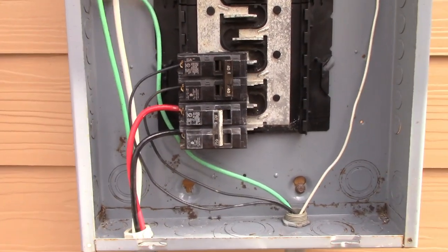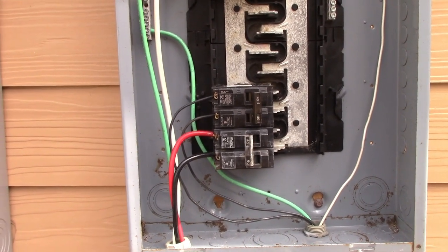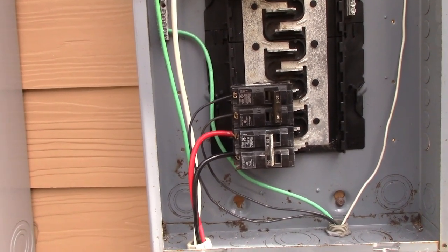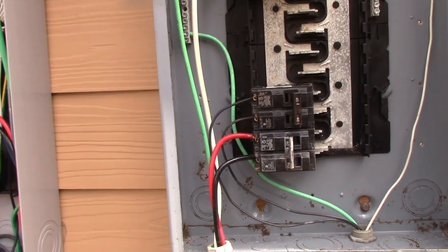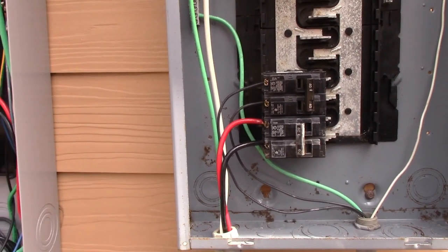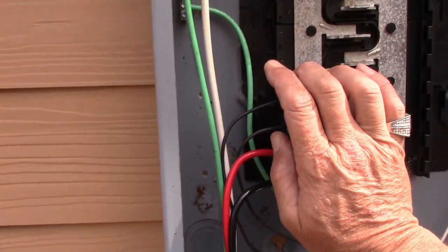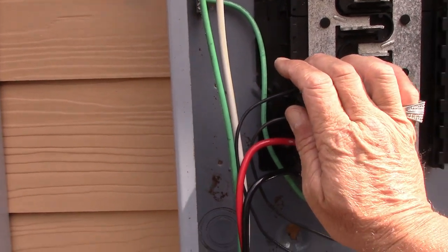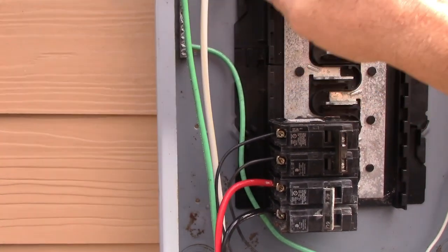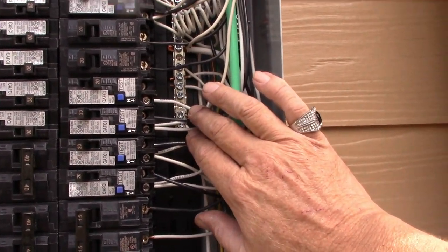First step is to make sure you can get an interlock for the panel you're putting in. If you're building your own transfer panel, you're buying a panel from the start. When you call an electrician, it's good to go out and buy your own materials to save money. Buy the panel, ask whether you can get an interlock for two branch breakers. Make sure the interlock kit is branch-to-branch, not just a main interlock. For arc fault, you connect both the neutral and hot from the other panel; for a standard breaker, you only need to connect the hot.